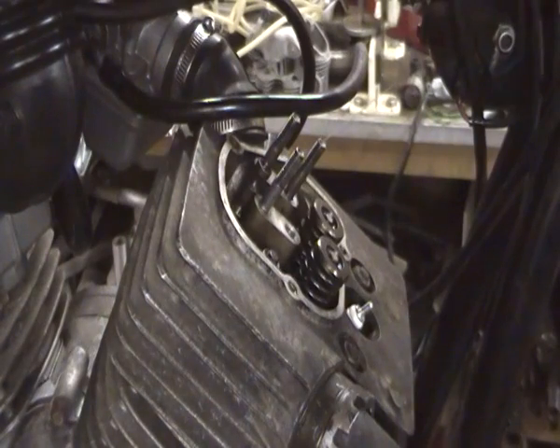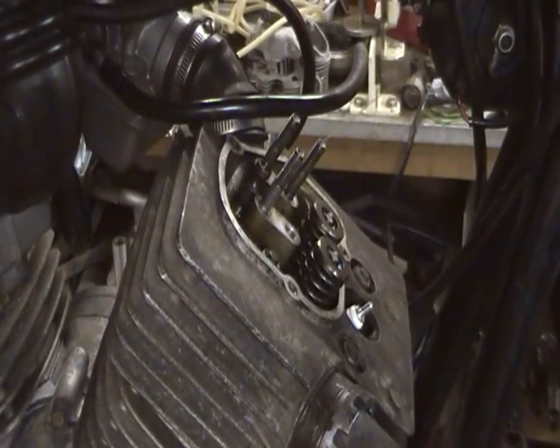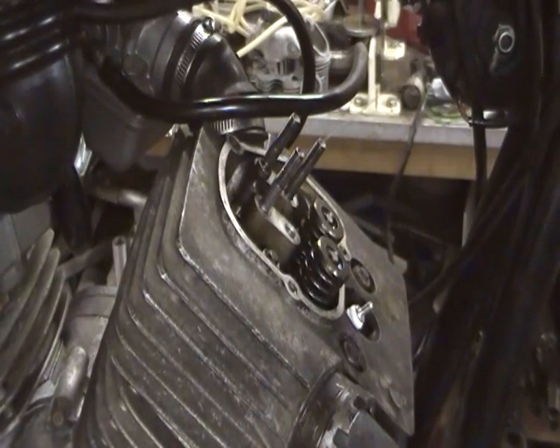I got it fired up. The valve gear was a bit noisy so I stripped it down to take a look. The valve gear is a little bit worn and I'll be refurbishing that shortly. But one of the problems I discovered was a stripped thread on a rocker stud. It all came apart apparently with no problems but there was just a raised ring of metal around the stud, which was suspicious to me. So I pulled the stud out and it came out complete with most of the thread.